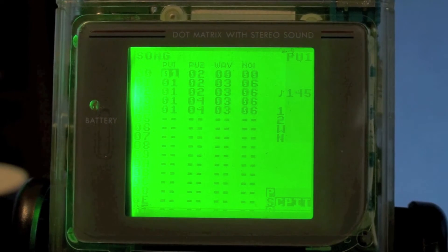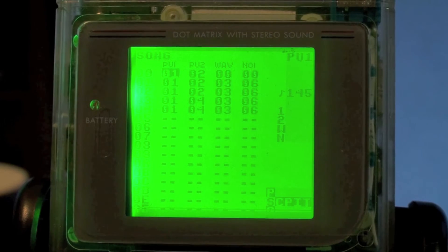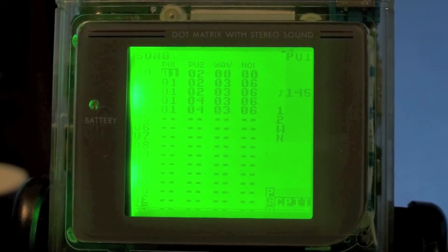It is difficult to get really bassy notes on some of the channels on the Game Boy. If you were to speed up the music yet slow down the system, the speed of the music will stay the same if you do it right, but the notes themselves will transpose down, so you get a much more bassy sound. Let me give you a demonstration of what this sounds like at normal speed.